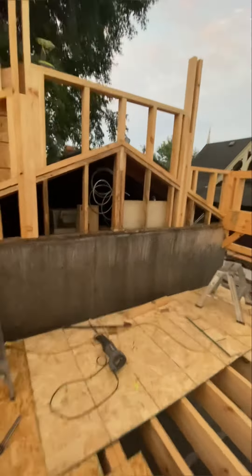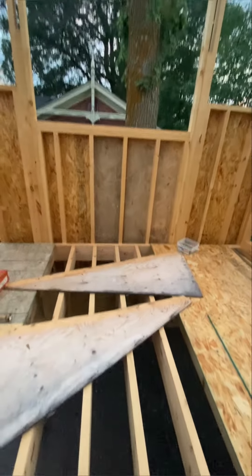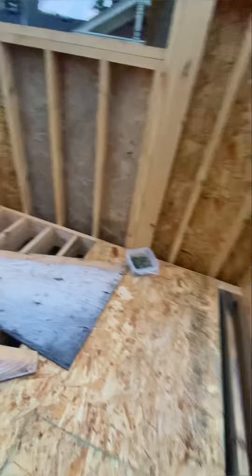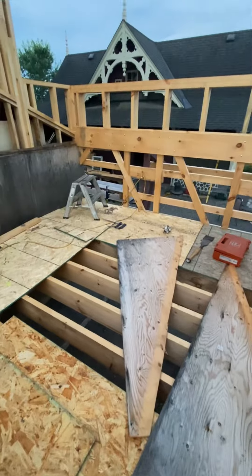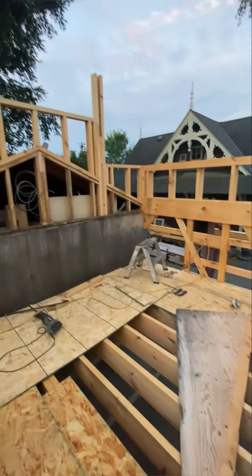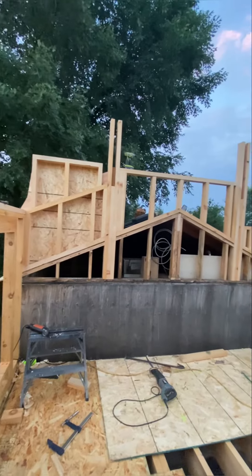What a horribly hot day, guys. Made it through — supposed to break by Friday. You're probably wondering why they don't have a floor deck. That's because I'm not buying plywood, guys. We're going tongue and groove plank flooring, 16 to 20 inch widths. So I want to get a roof on this before I put that type of stuff on. Anyway, thanks for following. Please comment. Let me know what you think. Maybe it's starting to make sense.